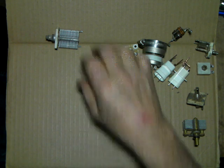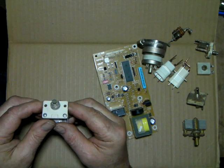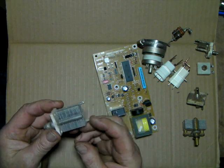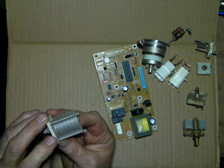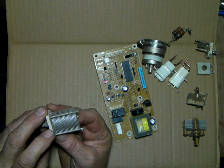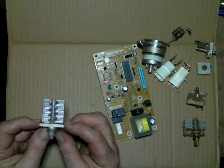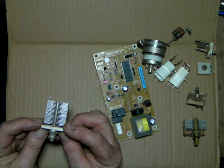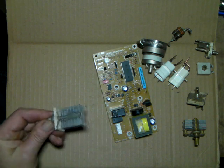There's also this style that's out there. This has no long shaft, so you won't be able to put a knob on it, but this would work just as good. This one measures 250 picofarad. I'd probably pad that with like a 100 picofarad cap at 1 kV or something like that. That's the load controls.